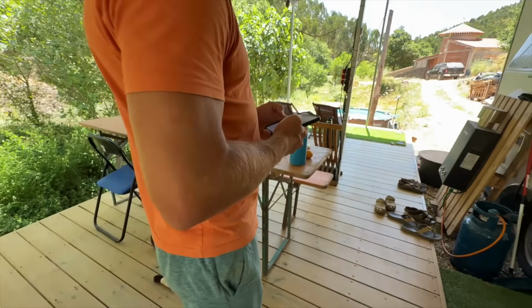Going for it. On second thought, maybe not. I've just been trying to research to understand, could we put the linseed oil on those lintels and bring out the color of our wood before applying at a later date the wax that would be on them? And what I've learned is that is not a good idea, because if we put it on there, we'd have to let it cure, touch it up, scratch sand it, and then reapply the wax coat.